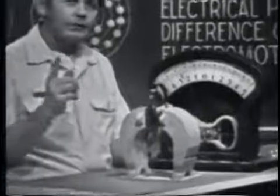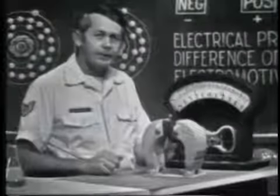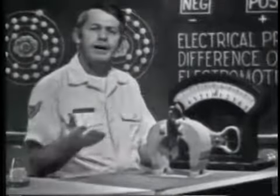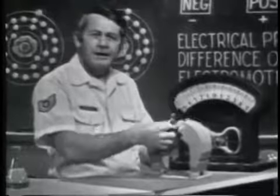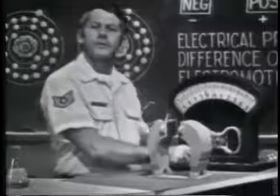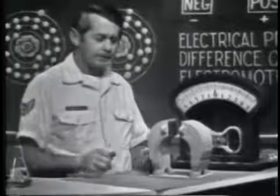You'll talk about AC in detail later on. For now, realize that it is different from the voltage developed by the chemical method. To obtain the motion, I had to mechanically move the conductor — that's why we say voltage is produced by mechanical means. Generators and alternators use this principle to develop a voltage, and the motion is usually developed by rotating the conductor.